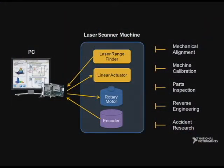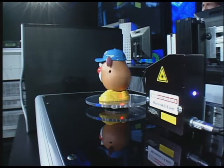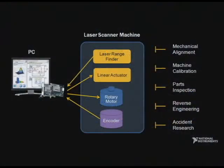We're going to perform a 3D scan of an object and bring it into LabVIEW. We've mounted Mr. Potato Head on a rotating platter, and next to him we have a precise laser distance sensor from MTI Instruments mounted on a linear actuator. As the platter rotates, we measure its angle with an encoder, and every time we reach 360 degrees, we move the laser up to scan multiple planes. This is a complex application with many elements to measure and control. In fact, we need four counter timers to interface with the scanner system.